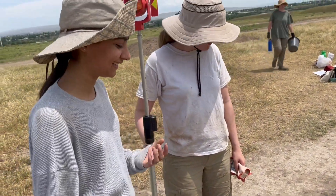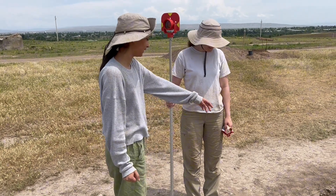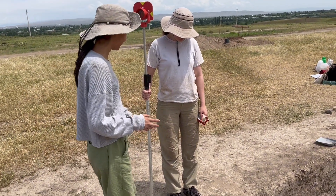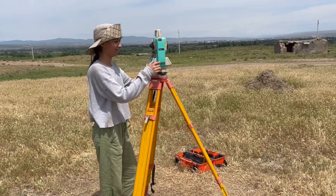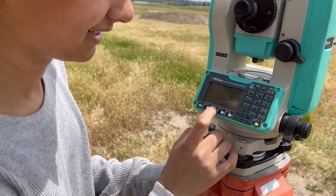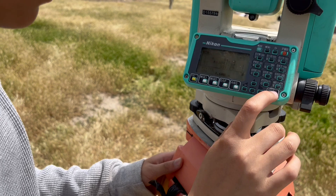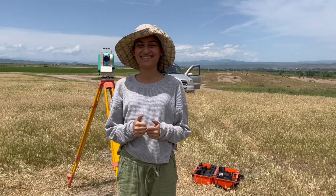There are going to be multiple points taken throughout the excavation, so I'll have my partner go down there and we'll measure one of the openings, which we believe is a mouse hole or possibly a burial — but we'll get the elevation for it. We press MSR2, which is our next point. The machine will beep when it's done. And that's the total station.